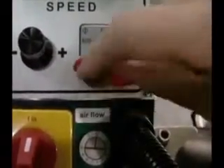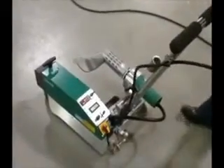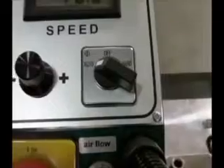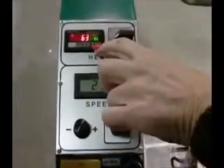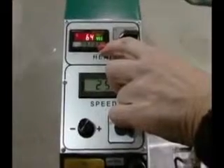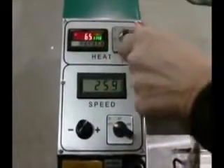To the right of the speed dial is your drive knob. Hand will make it move automatically regardless of whether the nozzle is engaged. Auto means the machine will move when the nozzle is engaged and then stop when it is pulled out. Off means no movement at all. The top switch is your heat switch — push the arrows up or down to get your desired temperature depending on the material to be welded. It is usually somewhere between 900 and 1148 degrees.